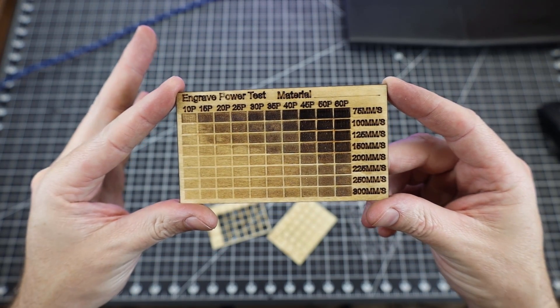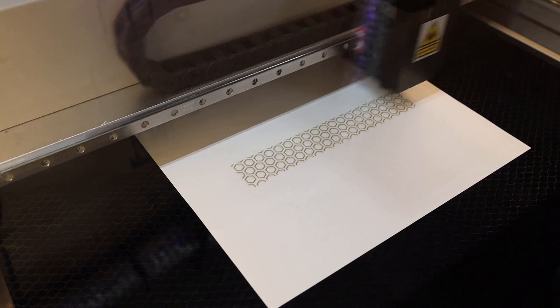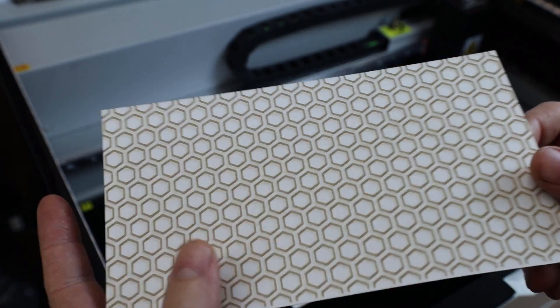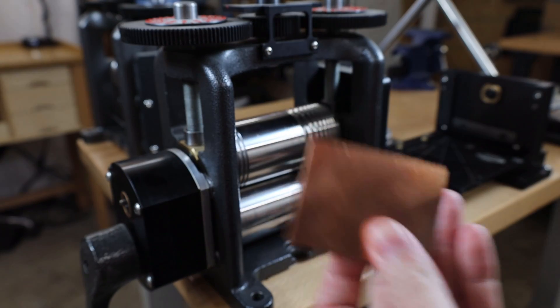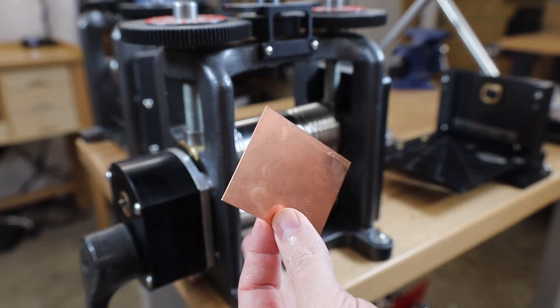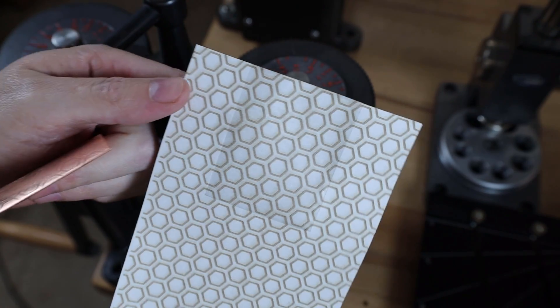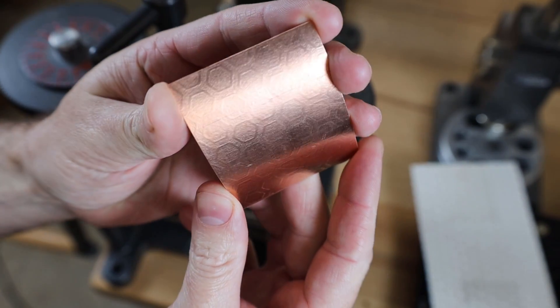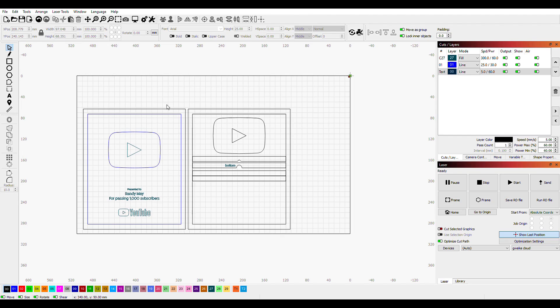This engraving test card comes in really handy, especially if you're trying to do something like paper. I'm putting a honeycomb pattern into this piece of cardstock. The reason why I'm doing this is because it will actually make a texture of the honeycomb into this by burning away some of the material. Now I can transfer that pattern from this paper onto this piece of copper using a rolling mill. You can see how much it flattened out that spot on the paper, but now the copper has the pattern from the paper. With the laser, you can technically make whatever patterns you want, and you don't have to design things in Lightburn — you can do it elsewhere in Inkscape or Illustrator.